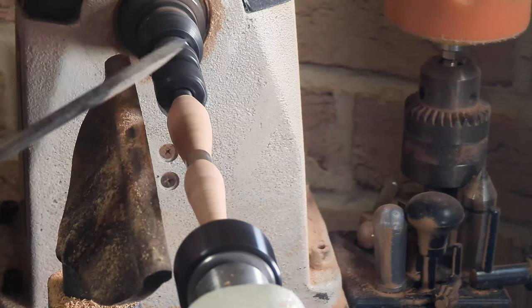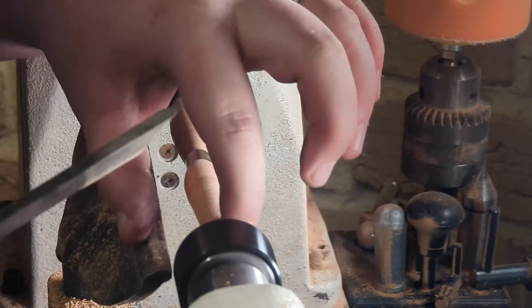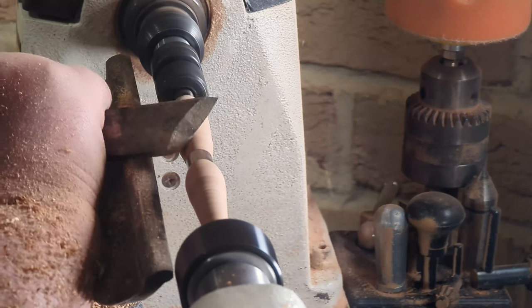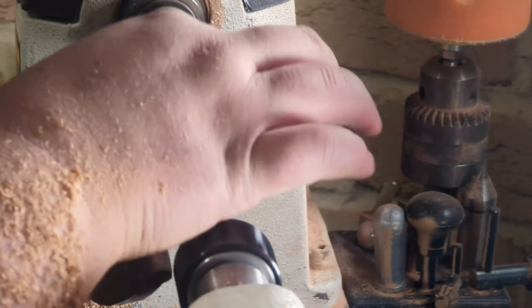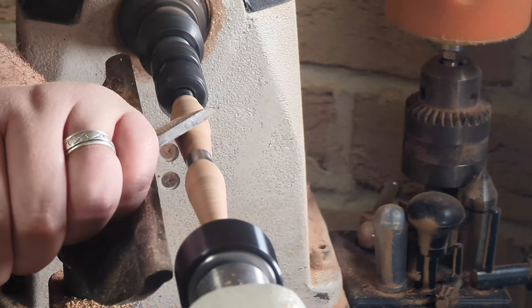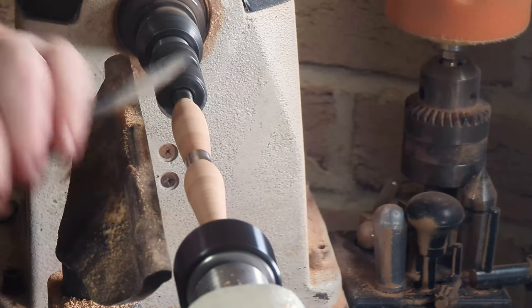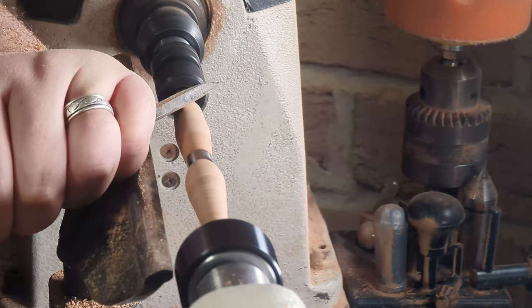This is less about the tool control on the tool rest and more about the me-control. You'll notice I'm going to put these into a barrel first and then I'm going to turn them down. With my streamlines, I like to have something to grip onto on the front of the pen — I don't like to have a super skinny. So I have got the bulbous centre and I like holding it that way. The feedback I'm also receiving is that a lot of other people also like it that way. The top of the pen, on the other hand, I do like to reduce as much bulge as possible because I don't want that pen clip getting obstructed or adding any additional wear onto the finish as it's going into and out of a pocket or on a binder.